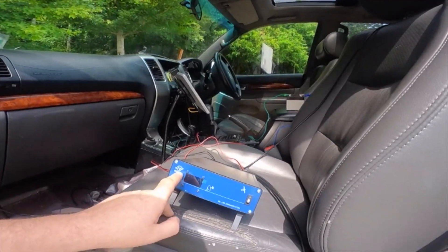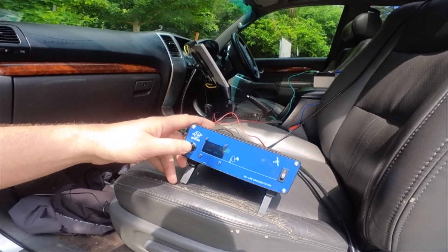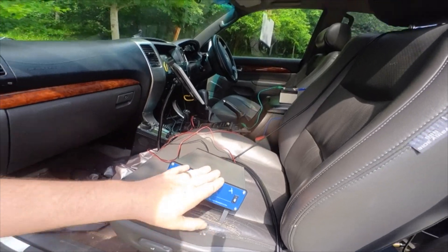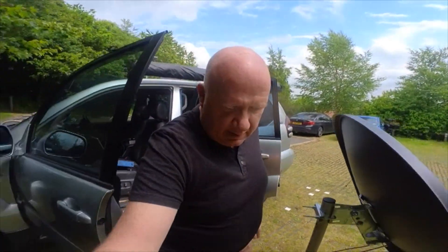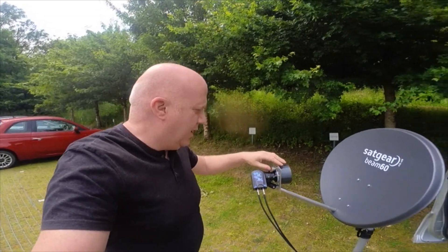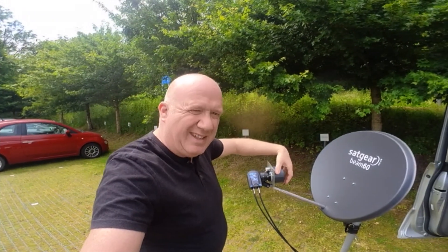Let me just bring you around. At the heart of this system is the DX Patrol QO-100 ground station — we're waiting to get a GPS lock on that. I also purchased the QO-100 LNB and the antenna for that as well, and there's the RF socket for the transmit part of it. The LNB is the receive part of this system, and the outer part is for transmit.